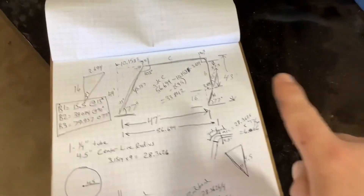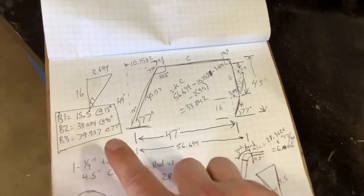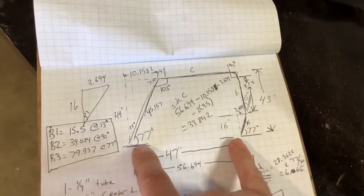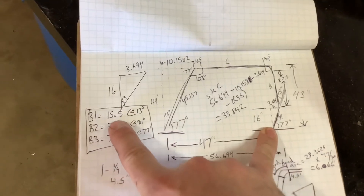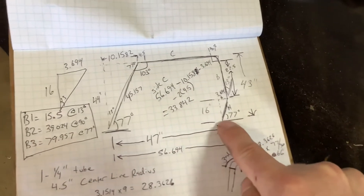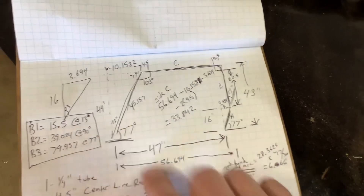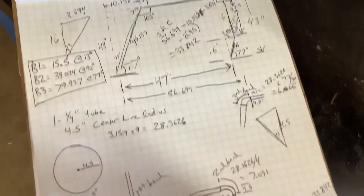I'll have a cage that is shaped about like that. This last bend — the third bend — I'll basically just control based on all of my tolerances stacking up and the fact that I want 47 inches here, and that this point is about one inch lower than this point. My first bend, I'm going to add a little extra material — about a half inch — so I can trim this angle as the plate is bolted down to the car. Same here — I'll trim that as needed. I'm going to take a full stick and start bending and see where I land.